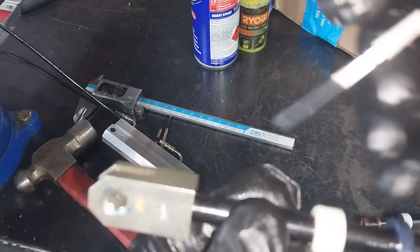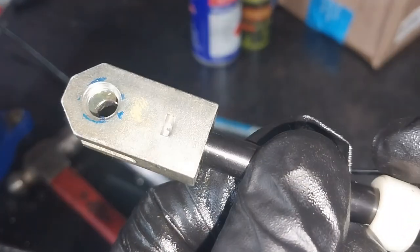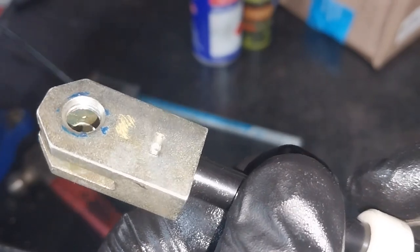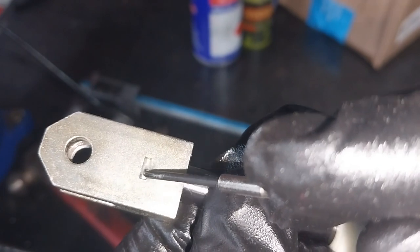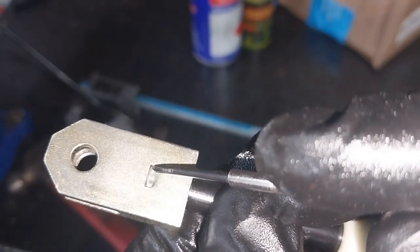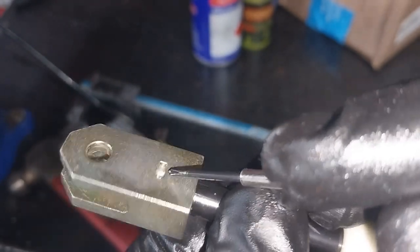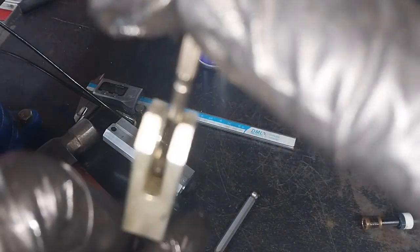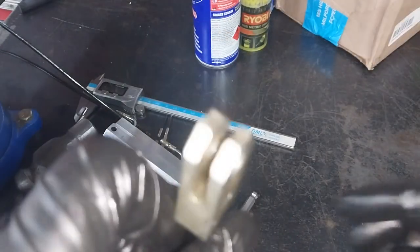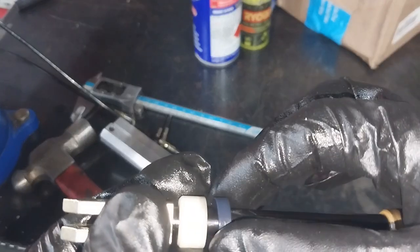This rod at the end will probably have a groove machined into it, so we're going to have to drill this out. I'm going to measure the width of this and get a drill probably close to that diameter. I've already center-popped it and will actually drill down, then with a very thin pin push down through the top there to knock them out and split them apart — so I can get this off, get that seal off, and put a new seal on.